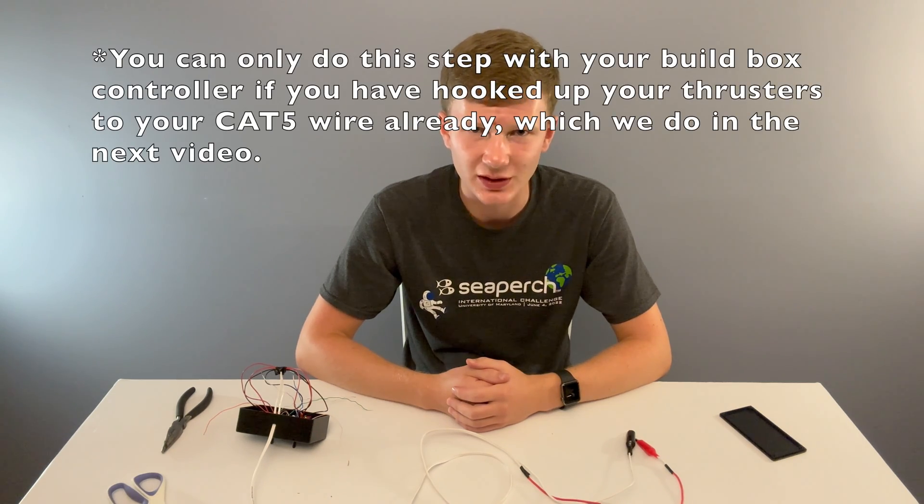The way to check your controller without the multimeter is to put in the fuse and hook up the controller to the battery. If the fuse blows or you see a spark, it is the equivalent of the multimeter reading a 0 when it should be reading a 1. Remove the battery, fix any solder bridges or short circuits, replace the fuse, and try again. Using a multimeter will save you a lot of fuses, but not everyone has one, which is why I included this other method. Now that we know there aren't any shorts, you can check each of your switches with a thruster. If you haven't prepared yours yet, I have a video on that, but you can use an LED or a motor you have lying around. Hook up your controller to power and hold together your thruster's wires with a pair of colored wires. Now activate the switch and see if the motor comes on. If it does, try with each of the other pairs of colored wires to confirm that every switch works in every position. If the motor doesn't turn on or is slow or weak, you might not have enough solder on a few of your connections. Recheck, repair, and try again.